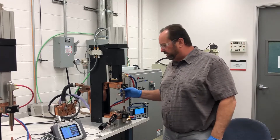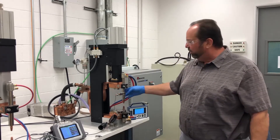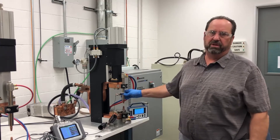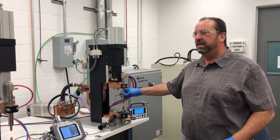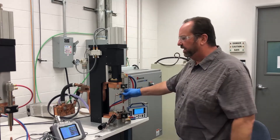We took measurements with the voltage clips across the electrodes. That's monitoring what happens right at the business end — right across the parts — which will tell us if the plating has changed, if the thickness of parts has changed, or any time the resistance has changed at that interface.